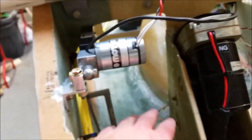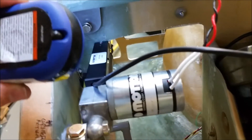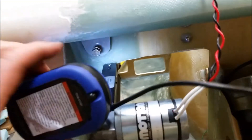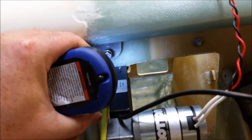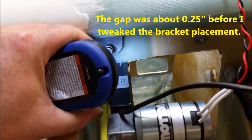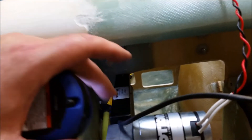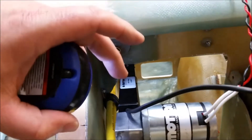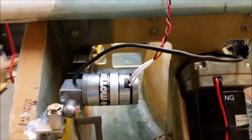This is the business end as far as the motor. It's turned horizontally so that in this area right here I have clearance for my foot for the rudder pedal and brake pedal. There's one other thing I was trying to accomplish which I finally got tonight — right in there where I'm shining the light, I was trying to get that about a tenth of an inch, maybe 0.15 inch, away from F22 to the edge of this actuator. This right here is actually the potentiometer, which through this cable sends reporting data to the EFIS as to the actual position of the pitch trim unit.